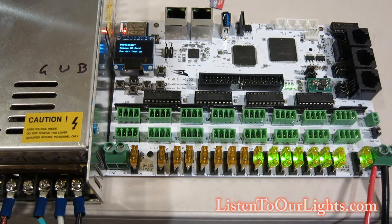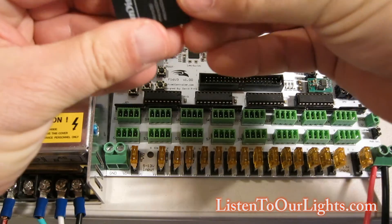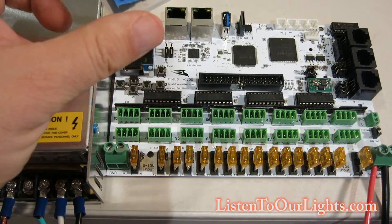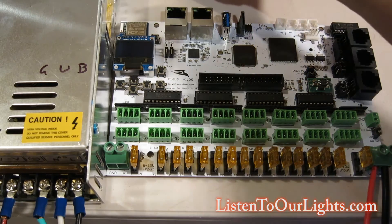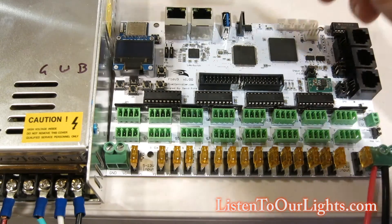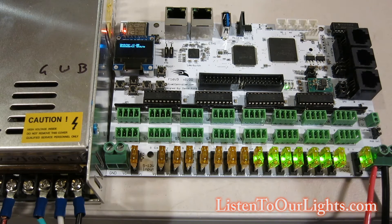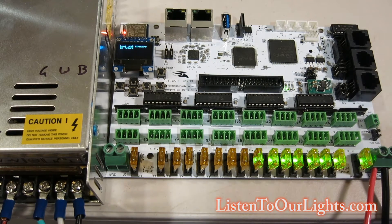I have the SD card out, then I power off and let it power down all the way. I'll put this card back in its protective sleeve. This SD card had the bootloader updater version 1.0 — I've marked it as such in case I ever need it again. I created a second card that has the actual updated firmware. Powering back on, it says 'updater successful'. Now it says 'load the FL2 firmware'. According to the instructions, updating the bootloader only needs to be done once, so in the future I just use the firmware card.